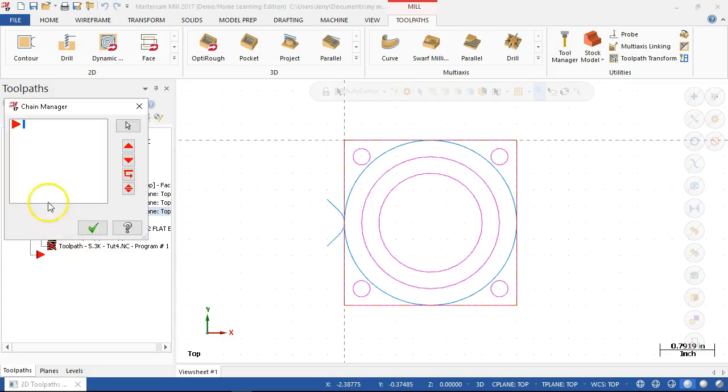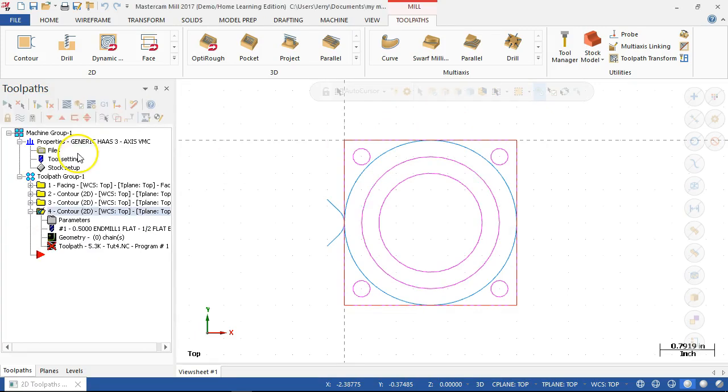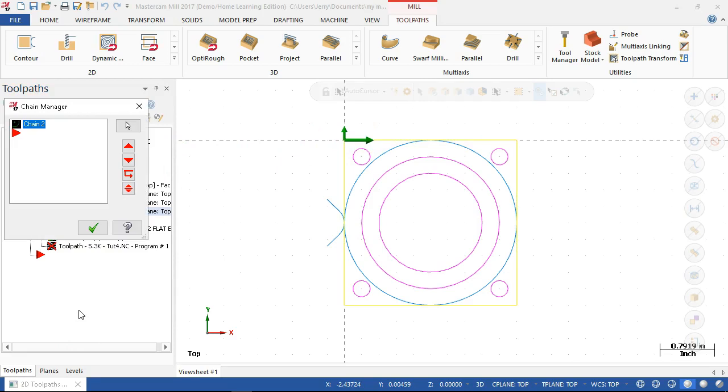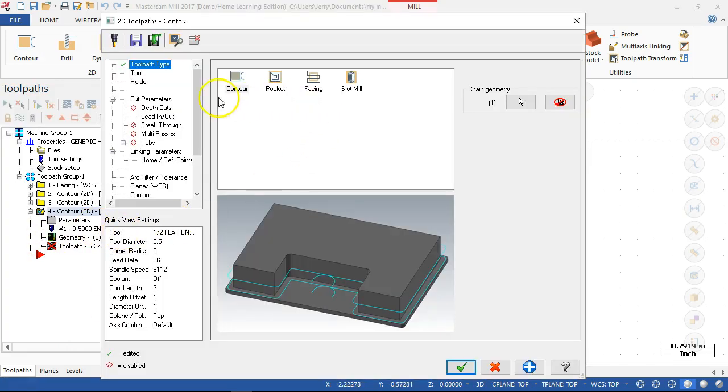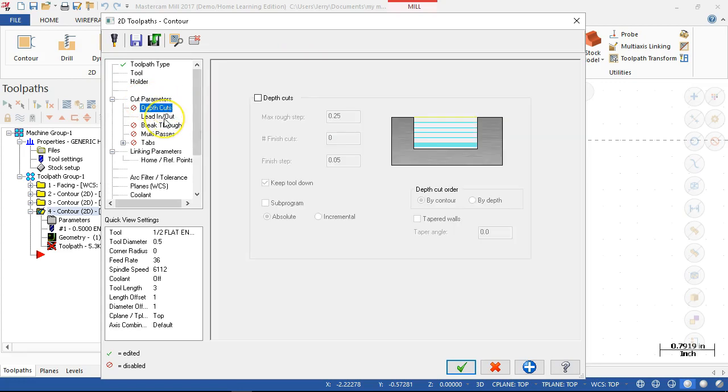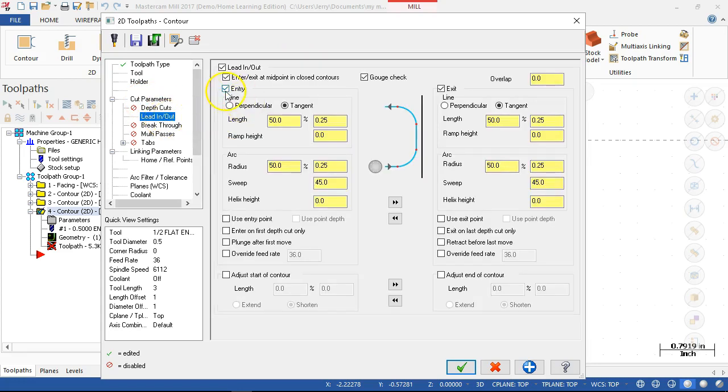So that chain gets deleted, and we go back in and add a new chain, picks up the geometry, and we go ahead and accept. Arrows to the outside, pointed in the right direction. Cut parameters, set up for wear, no stock to leave. Depth cuts, none. Lead in, instead of having it start at the midpoint and go with the arcs, because this